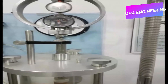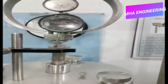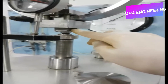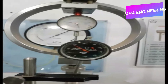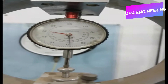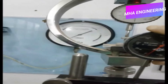Using this keypad and pressing the up key, the machine will start to rise. Once this stand comes in contact with the deflection dial gauge, it will start to rotate. Similarly, once this pad comes in contact with the piston connected to the proving ring, the load dial gauge will also start to move. The moment you see movement, you are supposed to stop the machine. After that, you will set the load dial gauge to zero and the deflection dial gauge also to zero.